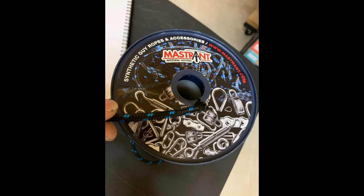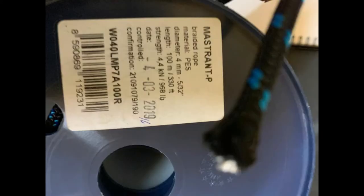This is important — this is the nylon rope that we used. It's a special rope we got from DX Engineering. It's sun resistant and UV resistant, and it's extremely good quality. I recommend any time you use guy wires with nylon rope, or particularly a hoist to bring up a dipole antenna, always use this type of material. Don't buy cheap nylon rope at Home Depot because the sun will destroy it. I've had this stuff up for about a year and a half and it's as good as the day I put it up. Here's the part number — that's where we got it.